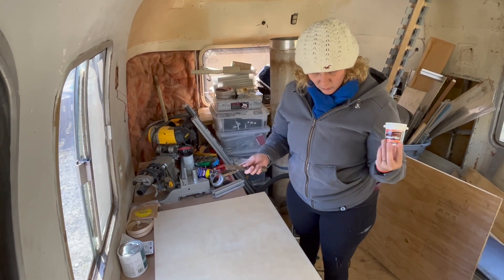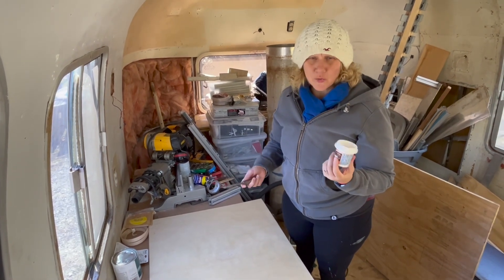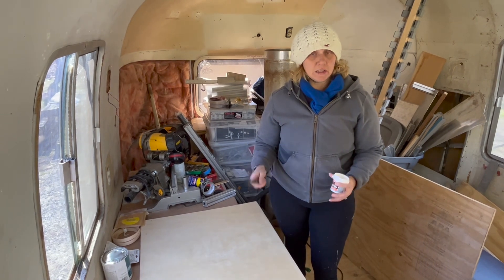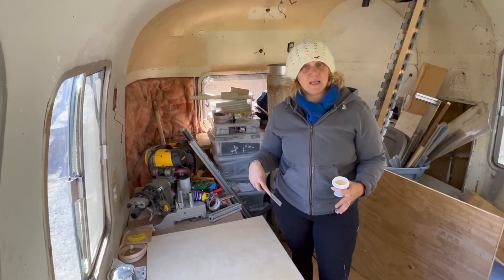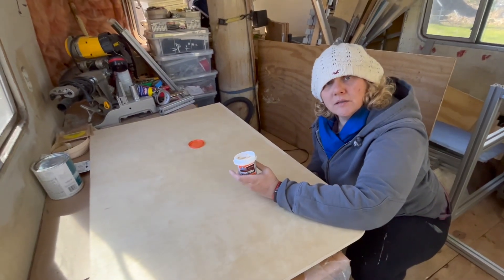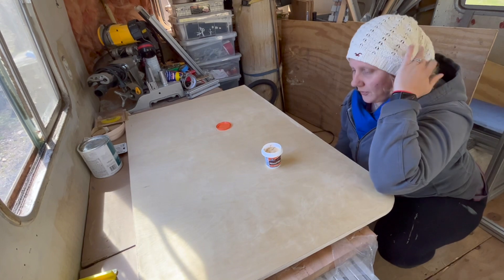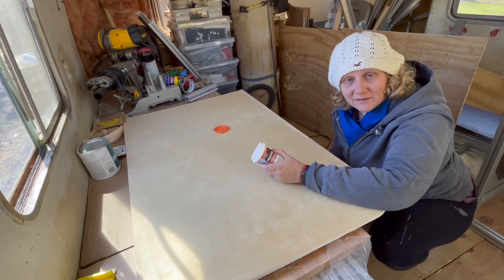It takes 24 hours before I can paint it with an oil-based paint. With a water-based paint it would be about two hours to cure after application. I'm going to try to get the chips covered on both sides, let it cure up, and sand it tomorrow — because it's still very cold. This little tiny tub of wood filler cost me about five dollars. I probably could have gotten two or three times as much for about seven dollars, but about a third of this will likely dry out and get thrown away, so the bigger tub would actually have been more waste.